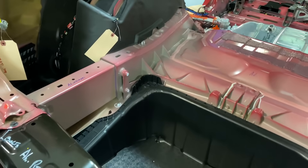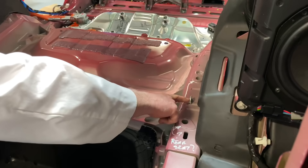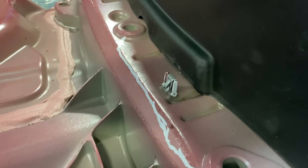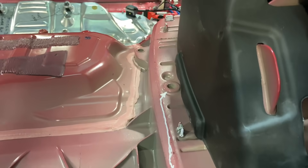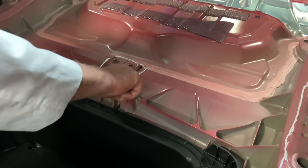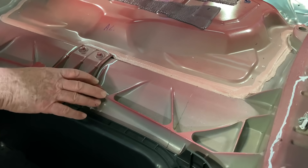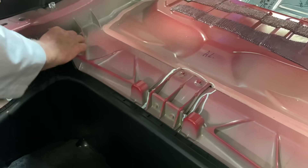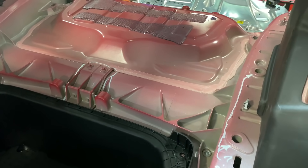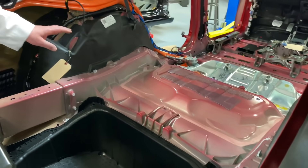Looking at these attachment points — these are brackets I don't have to weld on, and they're plenty strong. They're just cast in place. Lots of things can happen if you use castings, especially in aluminum. The casting is thicker in certain areas, which would also tell me that maybe those are seat points. In the normal webs, it looks like it's about three millimeters, maybe three and a quarter or three and a half, and then bigger where it needs strength. This is a lot of good stuff.